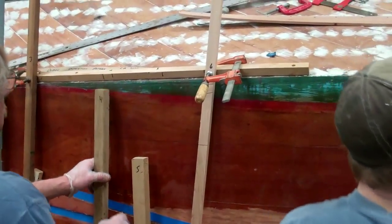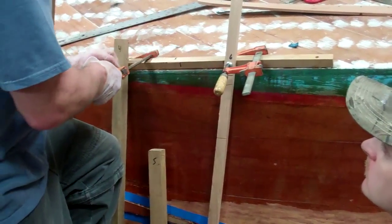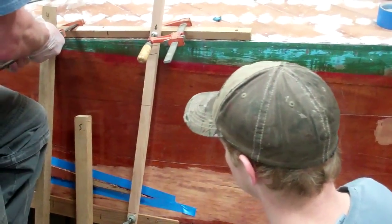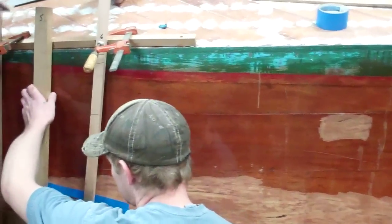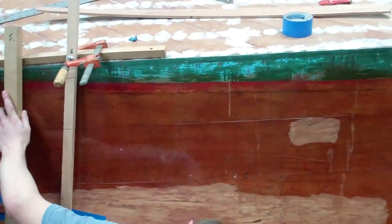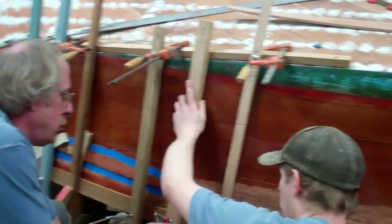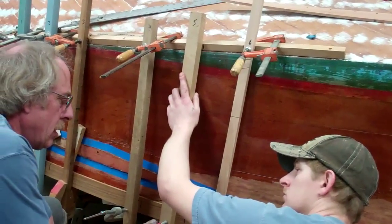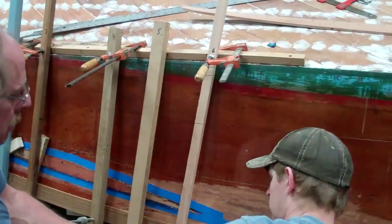I've got some screw holes — it is a bit thicker, probably a good healthy 8 — and that allows John to sand it in afterwards with a lot of control because the planks aren't a uniform thickness. For this kind of varnish I use a heat gun and a really good scraper — we buy expensive scrapers with BAHCO blades that last forever. It took me about 10 minutes to strip this with a heat gun.